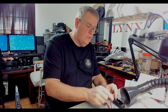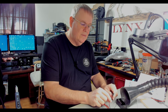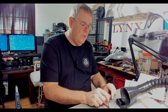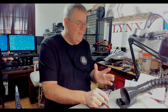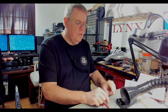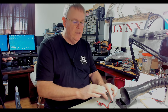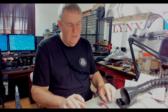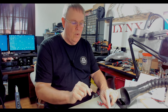Still got some concerns about the 9-volt — everything I've seen says it needs more than that. I'm really thinking about putting another one of these in series and adding another 9-volt, which'll get me probably about 19 volts, much closer to the 22.5 the schematic says. But I'm going to go ahead and try it this way, and if I have any issues I'll do that — it won't be hard.